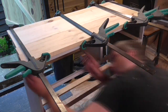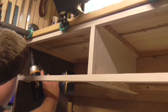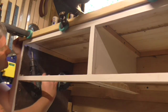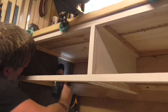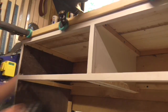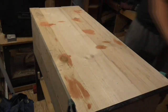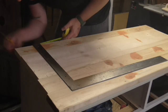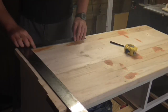I positioned the panel using a tape measure leaving about a 10mm overhang at the front, then fixed the panel to the frame at both sides and also in the middle where the centre drawer separator was. I added wood filler to any knots, small cracks or holes in the panel. I let the panel dry overnight and then removed the clamps. I used a framing square to mark up a straight edge and cut along this with a handsaw on both sides to square off the panel.